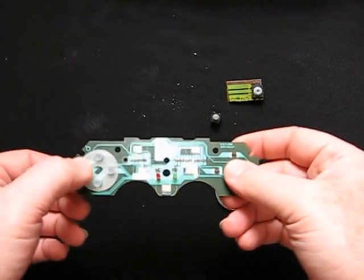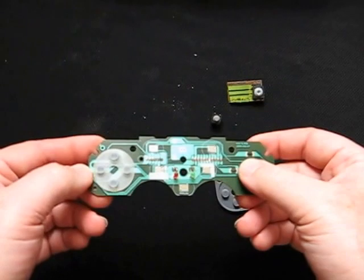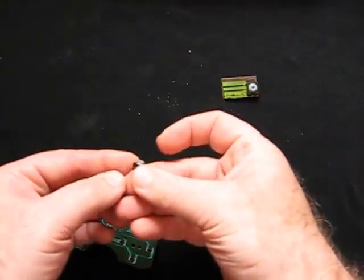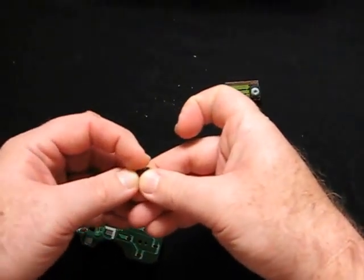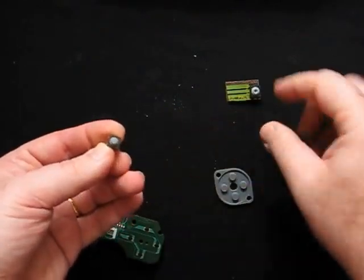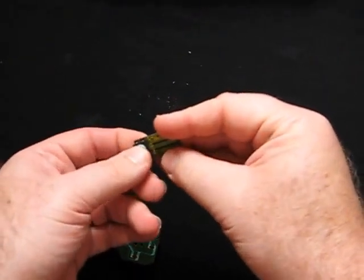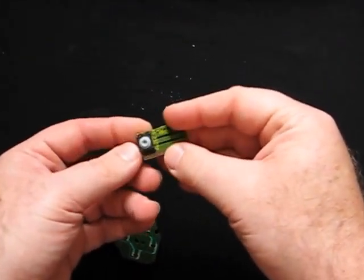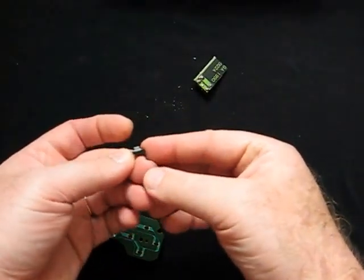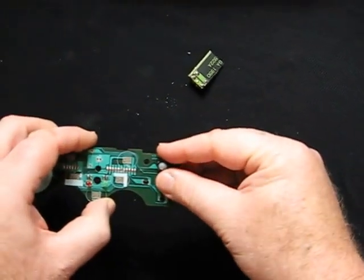The better approach is to cut up the relevant part of the board, wire to the traces, and utilise that type. The alternative is to use rubber-topped tactile switches, which do the same job — they have a nice mushy feel, a good angle of travel, and work very well. You can find them in old electronics — this one was salvaged from an old Sega Master System reset button. They're very cheap to buy, only costing a few pence each, and are ideal for mounting button switches.